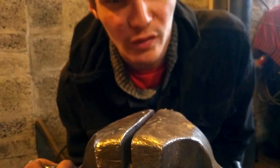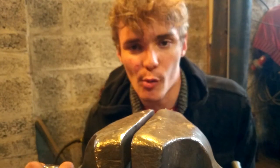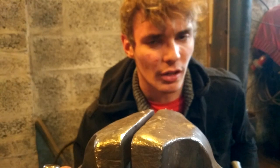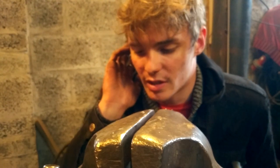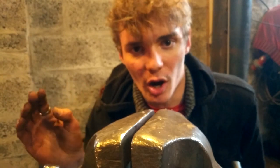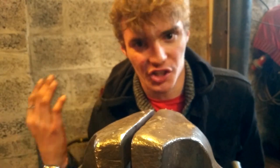Guys have to be patient with the heats. It takes a wee while because it's a bit thick. It's not super thin like how it started out. But, you know, it works the opposite way now because it heats up slower because it's now thicker. While in my previous projects, usually it gets thinner when I bash it rather than thicker. But this is like upsetting from a bar. And when you're squishing in the edges of any bar, it'll turn towards square, which is going to be thicker.